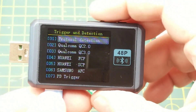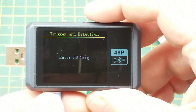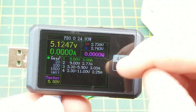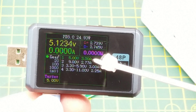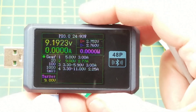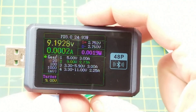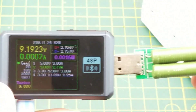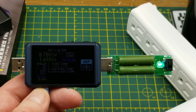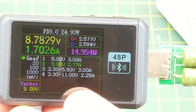Sometimes when the load changes mode it reboots this thing. Before it rebooted it showed that it has most of these modes and power delivery. Going down into power delivery trigger: right now it's delivering five volts at up to three amps, which is what this power supply says it can do. But scrolling through, we can force it to do nine volts — this is actual live measurement. Let's plug the load in; hopefully I don't blow out that LED with higher voltages. We're now calling for nine volts and up to 2.7 amps.